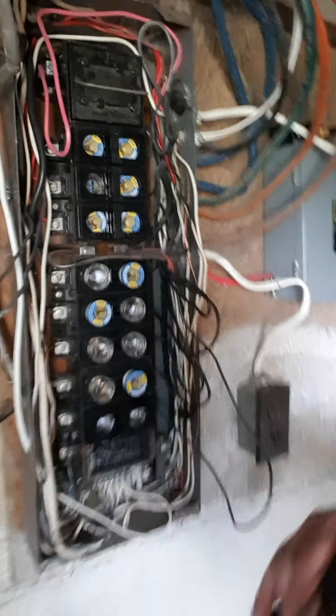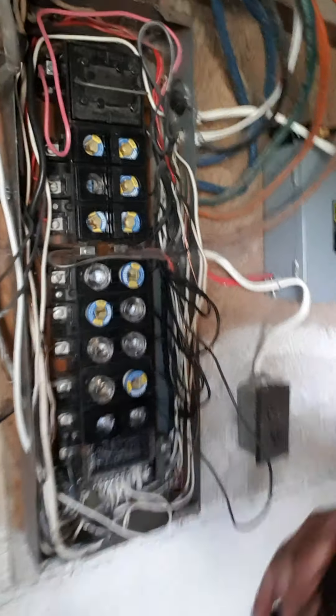We're going to come on over to this. Now, what do we call this type of electrical service? This is called a fuse box — fuse box missing a service panel, of course. Never a great thing. As we go through the box, we're going to get a little closer. Let me just shine a light in there. We are going to see some significant aluminum within there — significant aluminum mixed with our knob and tube. Some bad electrical combinations.